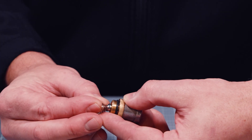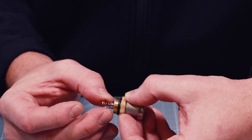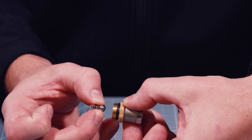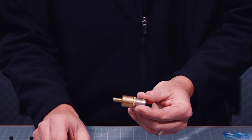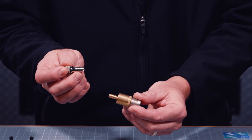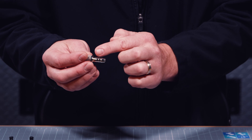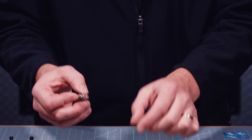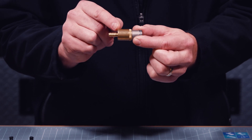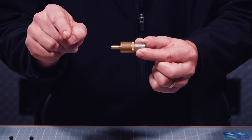We offer two versions with a spring and check valve, meaning there is a ball with a spring that compresses the ball against the seat to maintain restriction of backflow if the chem filter is in an upward position. For example, this version does not have a spring, so you can hear the ball rattling back and forth. While reversed water pressure would likely push that ball against the seat to prevent backflow, this other unit — upside down, sideways, it doesn't matter — has a spring that compresses the ball against the seat so that unless a vacuum is created, there can be no backflow.